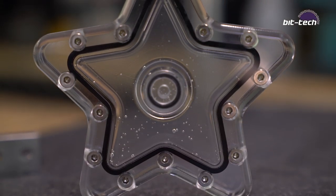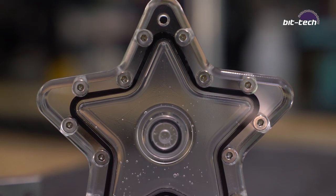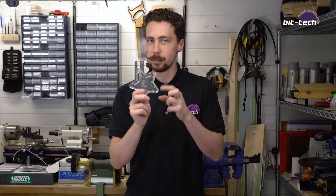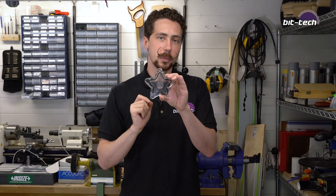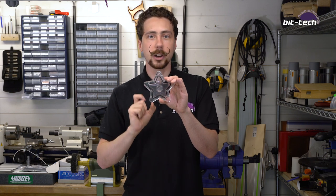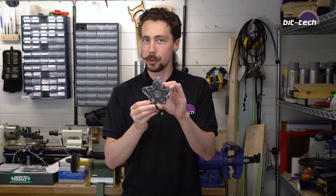You can't just do it on one side and then hope to do it on a machine afterwards without some special bits. Of course, what makes it extra difficult is you also have to do a 3D piece on the inside because I've made the interior corners curved as well. And that includes the recessed area because you're not going to have enough space otherwise to put your G1/4 stop plug in. So that has to be recessed from the back and it has a nice curve on the inside to make it a little bit different. And it hasn't got the same radius on the outside.